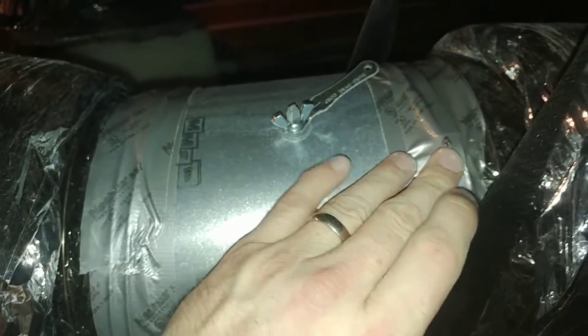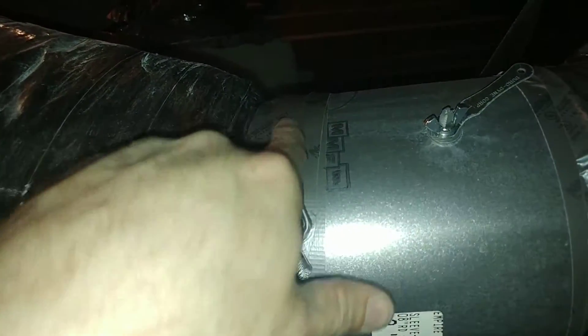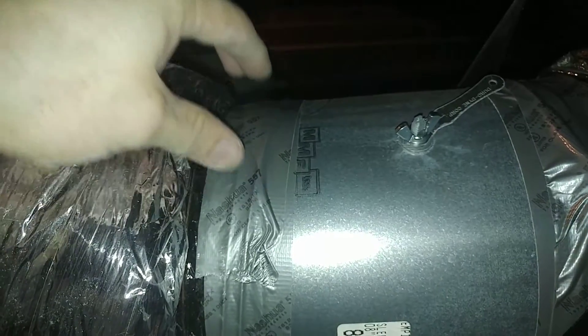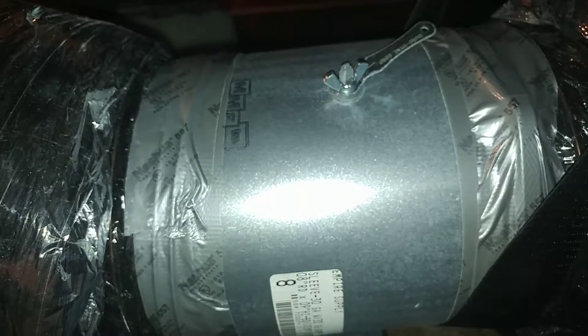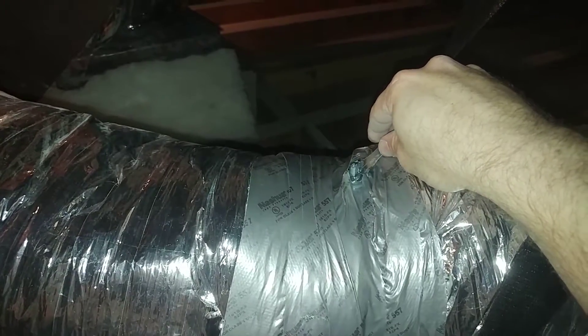The next thing is to take this part and overlap it. This side is all ready to go — the outer insulation will cover this, then tape, zip, and tape. This side has just started; I can see a couple of bands in there. I'm going to put the zip tie, then another piece of tape or two, then this over the top. Then we're going to bring both these together, have it all taped up, and then adjust the damper according to the flow we need down below. When it's all done, it'll look a little something like that. Just got to adjust the damper and see what happens.